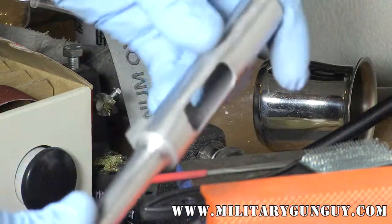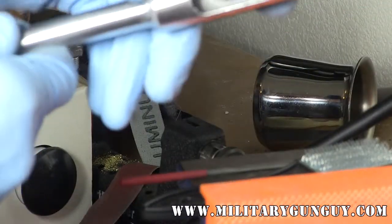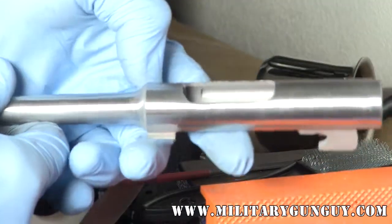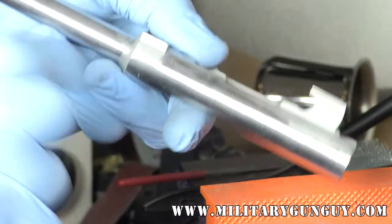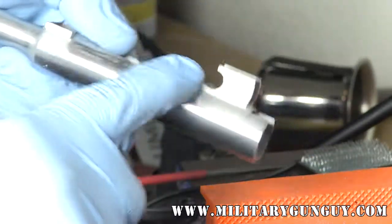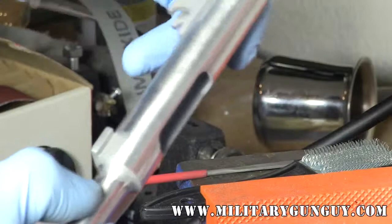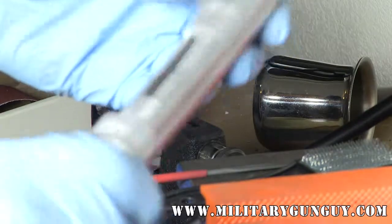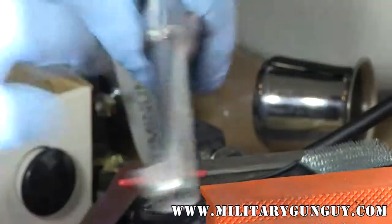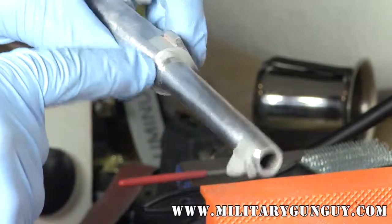Overall I'm very happy with this — it was really badly pitted when we started and it's now nice and smooth. I can get the smoothness down even further, clean this up, and blend this area. I want this thing to be as polished and as uniform as possible. A lot of this can be hit with a wire brush on a bench grinder, running it real quick to uniform the area up. You can also hit it with the bench grinding wheel to do the same thing.